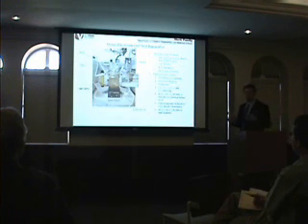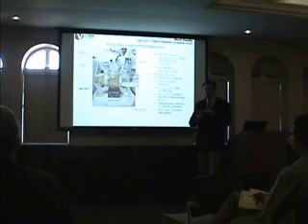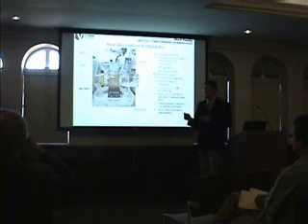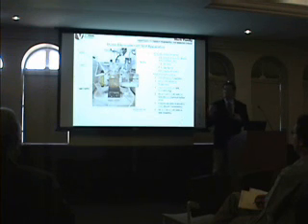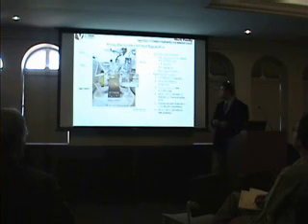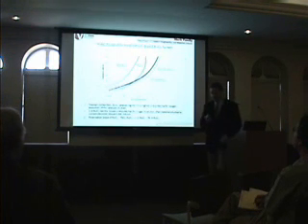Our experimental procedure was very simple. We wanted to characterize the materials, determine some kinetic parameters of the materials, and then determine stability. We used different tests — one was simply dipping the material in acid and figuring out what potential it was. Second, we polarized that material to see how it performed. And finally, we did a special technique called electrochemical impedance spectroscopy, which Professor Mansfeld, my research advisor, has helped develop over the past basically 30 years. And we were able to find some results.